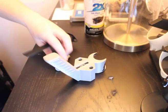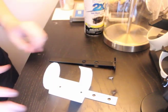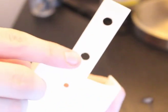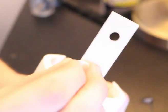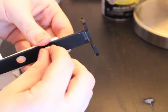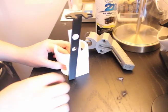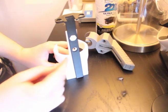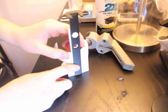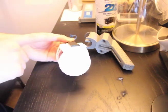Because this worked so well, we were able to move on to version 6 and version 7. Version 0.7 works by having extremely small threads inside of this little bit. When you place V6 in between the holder and the bolt — you have two of them obviously — you get this general structure. But as you can see, there is one problem: even with these two bolts in place, there isn't really enough stability on the bottom side. There's way too much flex between these connection points.